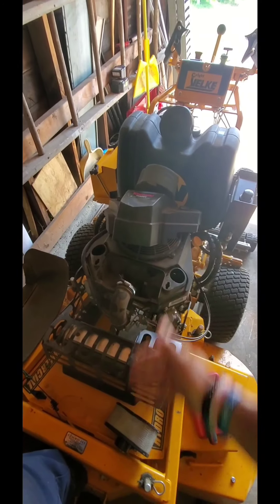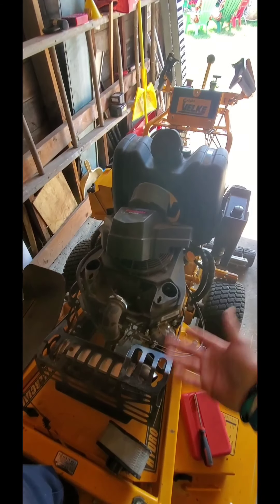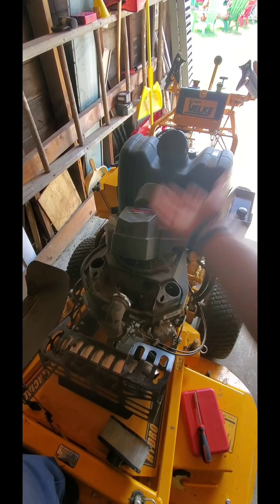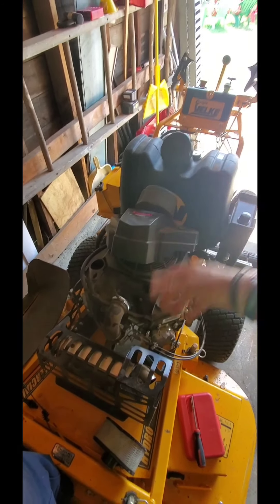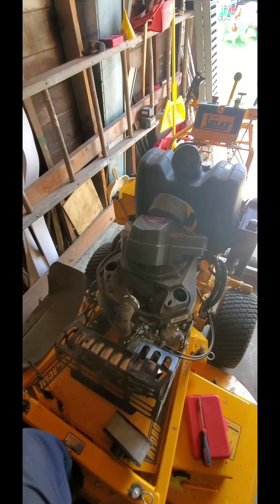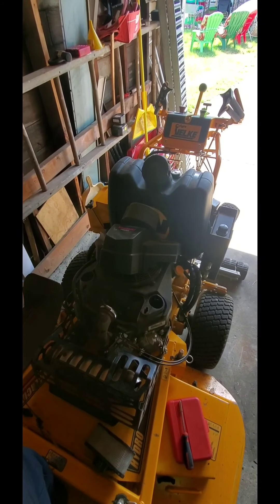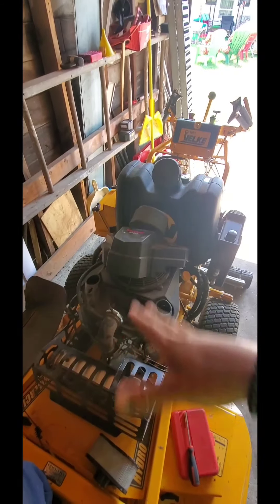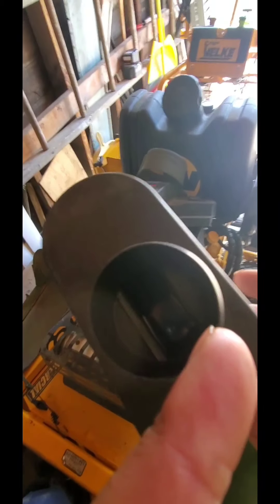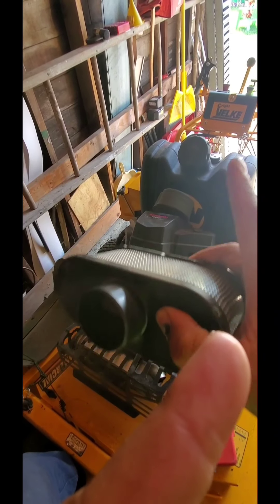They do a good job of thinking about the landscaper. When you're on a job and you want to check your air filter, you can easily within 30 seconds unscrew it, pop it off, shake it, use your blower, and blow it out from the inside out. On your filters, you don't want to blow from the outside in — you want to get the dirt out, so you go from the inside and blow the air so it pushes the dirt out.